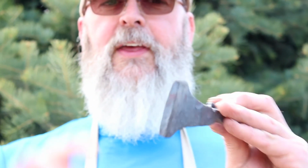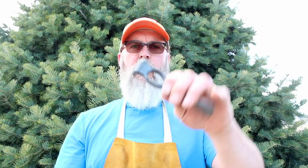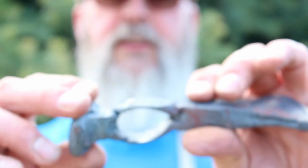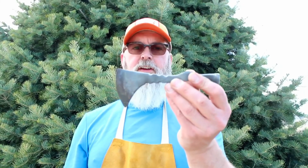The lessons learned were I flattened out the front and made it too wide, which made it too thin, which made it impossible for me to really get a cut down the middle so we could slot that high carbon steel in. And then as I was working on the handle part, I really mashed it up pretty badly, and you can see that there's lots of cracks and too many things in there. So we've called this lessons learned. We kept on using it as best we could just to learn some skills, and then from there we went to today's final quenched tomahawk.